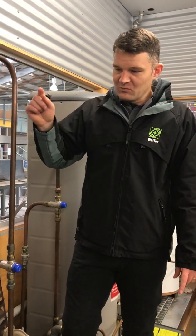If it fails, we'd have to look to increase the ventilation. You can work out how much you'd need by opening a window in the vicinity, opening it to the point where it's functioning again. That will guide you to what size openings you require.